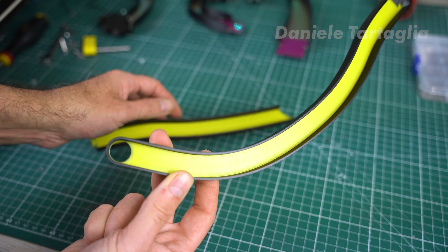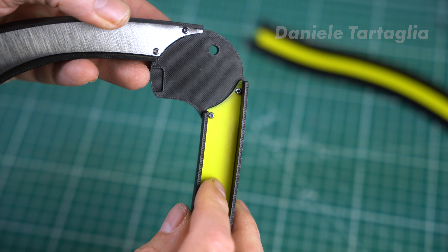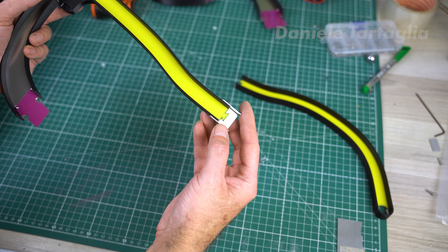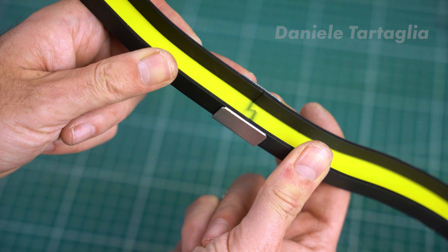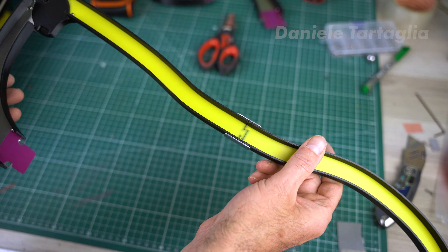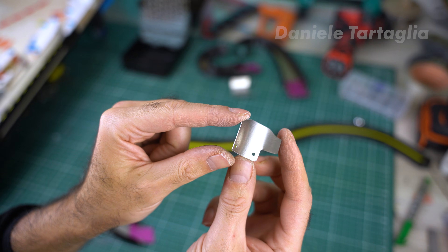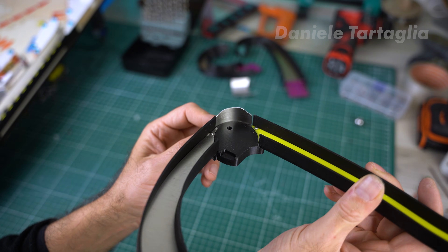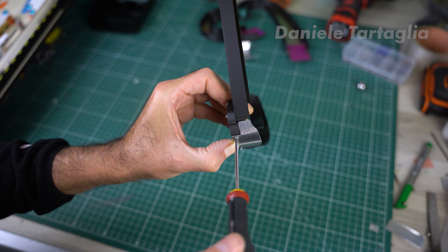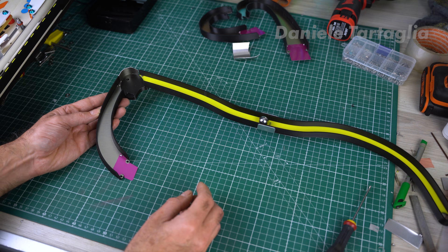The third ramp is finished with a two-color PLA bridge. Because it's very long, I made it in two sections joined by a custom-shaped aluminum profile, bonded with special double-sided tape. It's a very unique ramp and it wasn't easy to design. I also added a side rail so the ball can travel the entire length safely. It's made from leftover brushed aluminum, cut and bent by hand. Now that all three ramps are done, let's move on to the suspended wire forms.